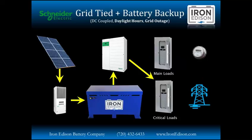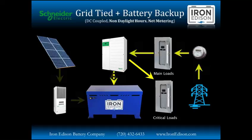If we see the grid go down, which we've seen several times here in the last couple of months, we don't even skip a beat. The inverter will detect that the grid has gone down. It will disconnect itself from the main load panel, from the grid, using anti-islanding technology, and the system will continue to operate, drawing energy from the solar panels through the battery, through the inverter to power the critical loads.